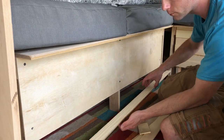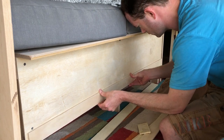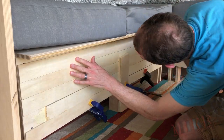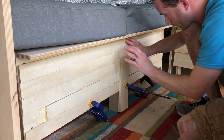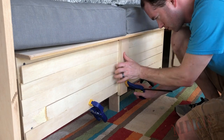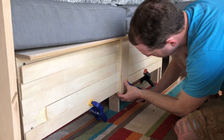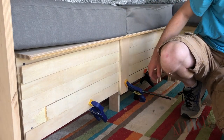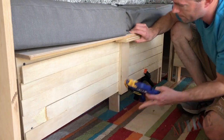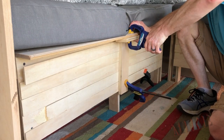Some quarter-inch here on the front between the legs, and some two-inch wide strips, just like around the ottoman. Unfortunately those screw holes don't get quite covered up, but I'm able to use some scrap pieces in between to allow those trim pieces to be spaced properly. A piece of three-quarter here in the front clamped on will hold this in place. Then to apply tension to the top, I end up using a block clamp to the bottom of the seat, and that applies pressure to the top of this little clamp bar — one in the middle, and then one at each end will finish it off. It's clamped up like so for a few hours, and you can see the other couch over there is already done.